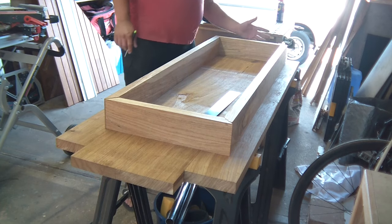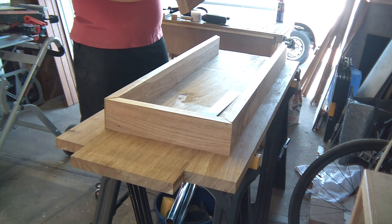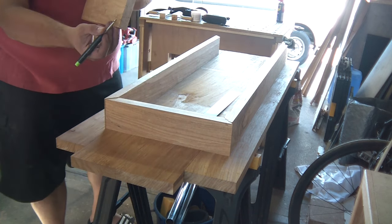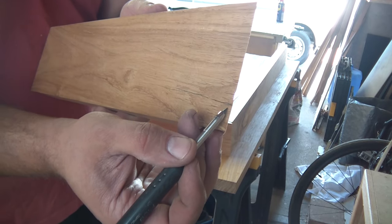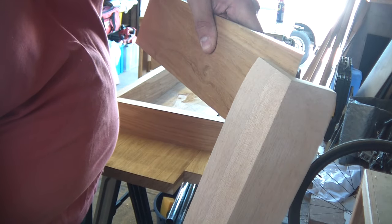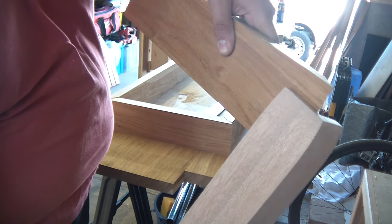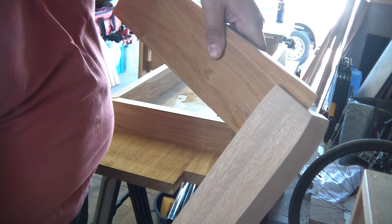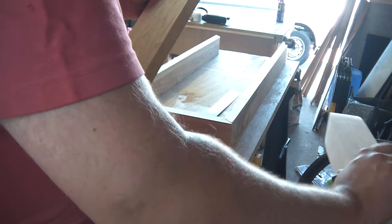And then lastly, I've got this board here, which has got a through split right here, which has got a split that goes through to the front. I'm positioning it so that one of these legs will cover that split, not only for aesthetic reasons, but also structurally. We want the strength in there. So it'll keep it from separating. The glue on that face will hold it together and it'll also hide it.